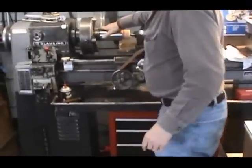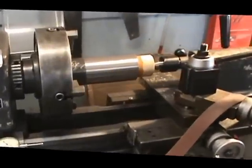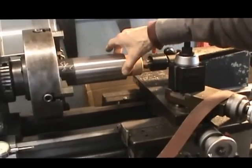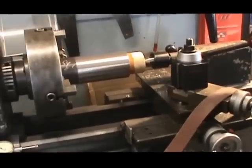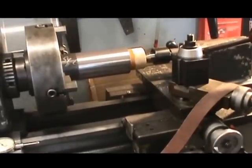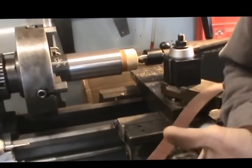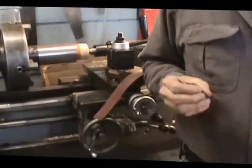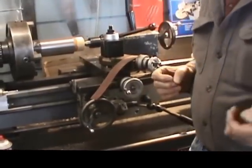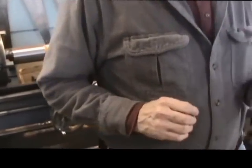I've got the dummy bearing in the machine. I've got it rough polished. It is now 10 thousandths larger in size than our finished bearing, which is the minimum clearance that we need. But because we're going to do such a nice job with this process, that amount of clearance is going to be really nice. This thing is going to run great.